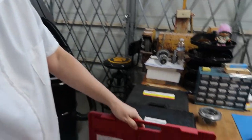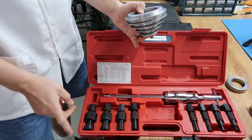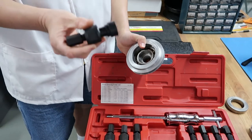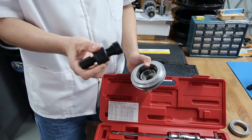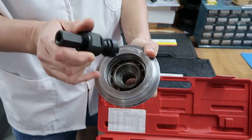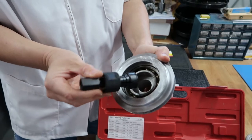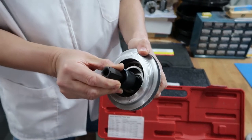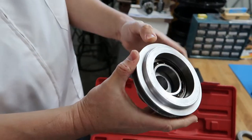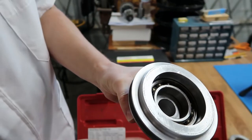Okay, so going back to this pulley, it would be nice if they made a size. This is the largest size I believe they make, and what we have. Maybe a little larger is available, but they don't have one for the size of this bearing. So you can see we're really far off. That's really undersized. The other big problem we have is, if you notice, we have almost no clearance underneath the bearing race right there.